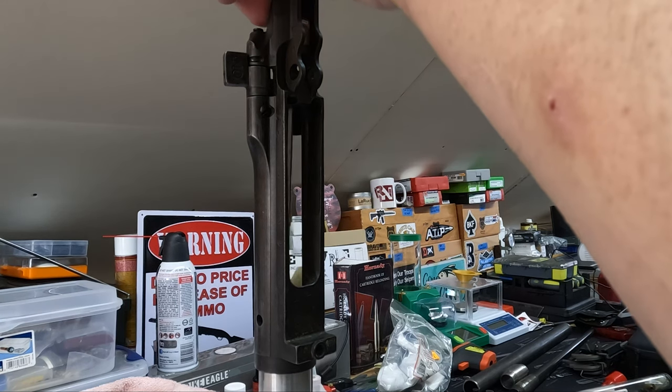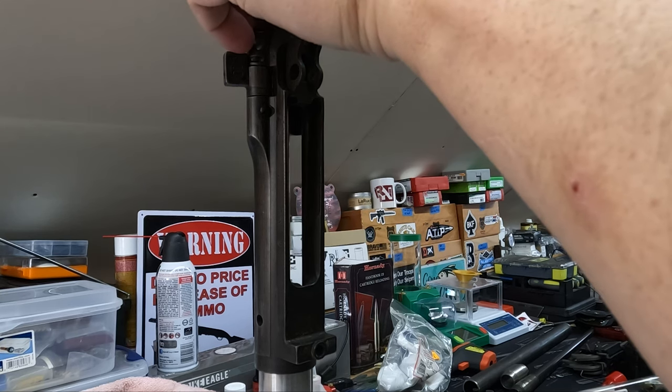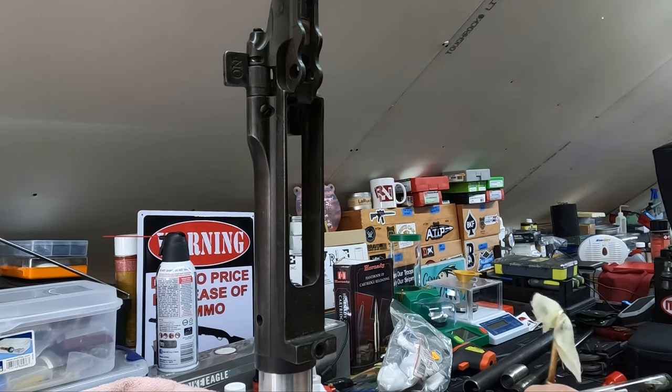And I'm just pushing this on down into the rifling, by the way, to get it past our chamber, because I don't want to be pulling it back up into it more than I have to with the patch. And so that pushes it down. And again, you'll see a little gray indication of material we cut. So before we do that again, we'll clean that out a little further now with a clean patch.